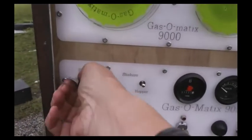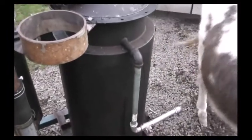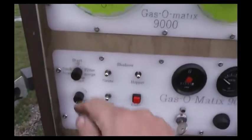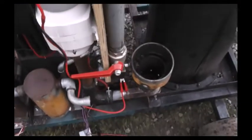When you turn this switch to backburn mode, you're activating this blower, which pushes air back through the radiator and into the gasifier to assist the manufacture of charcoal. When the start-up blower is selected, it turns that blower off and switches this one on, which enables the flare.